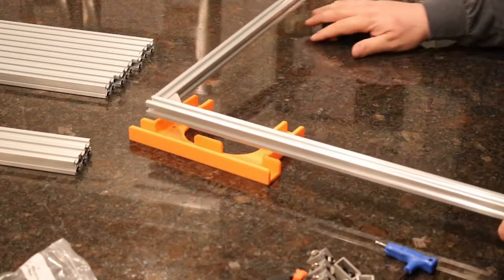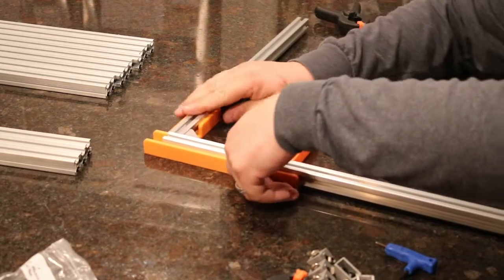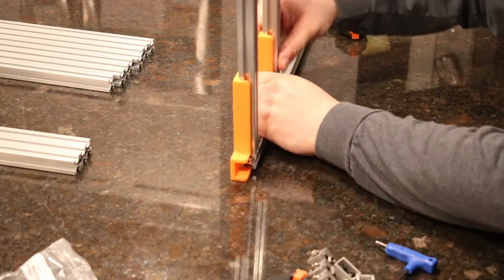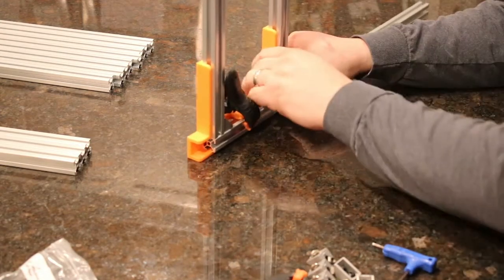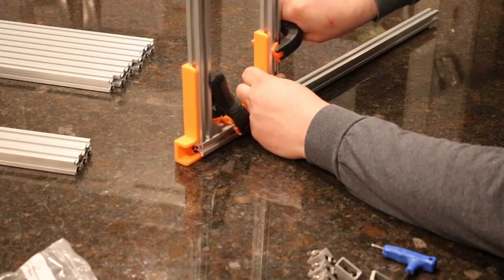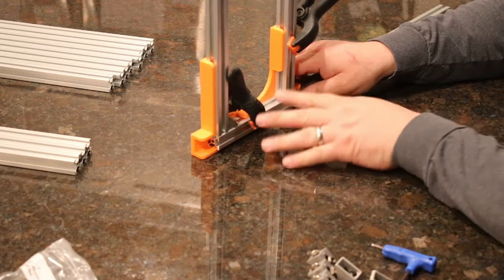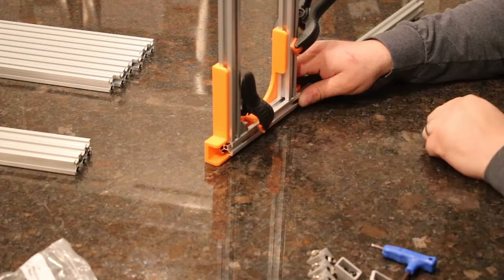We're going to place the next beam down by placing it back into the jig and pressing it firmly in place. Grab another 440-millimeter extrusion, place it in here, and push it firmly against the other extrusion. Place a clamp in the middle and another clamp to hold everything in place. This jig tool is really nice — when I first assembled my printer, I set the distance between these beams with a caliper. This is actually much more precise and ensures perfect parallel spacing at each end, top and bottom.